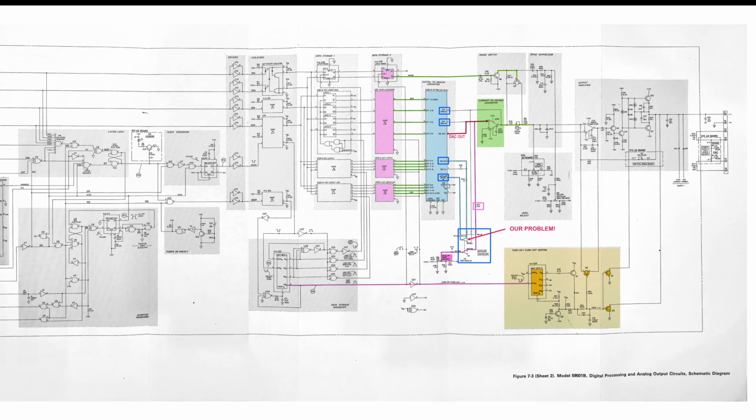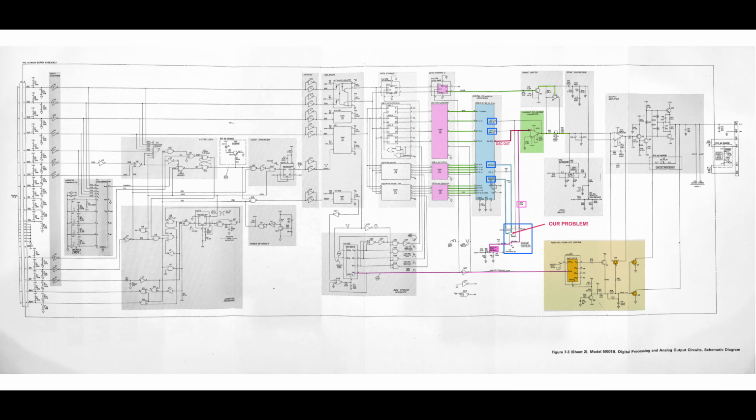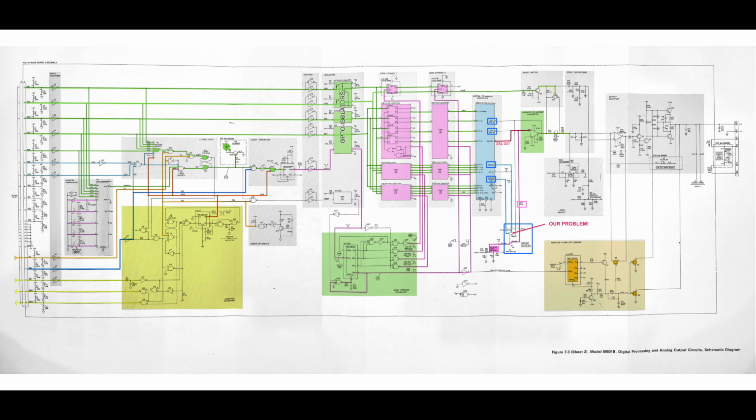It also uses the second shift register, conveniently left over from U25, to release the shorts only after the first load command is completed. That's it, sorry for the lengthy explanation. There is just a lot happening even in a simple HP instrument like this one. And I kid you not, the spectacular HP service manual explains most of this, if not more. Anyhow, thanks to the superb HP manual, we have a good hunch of what may have gone wrong, probably the